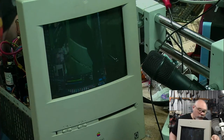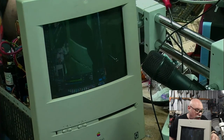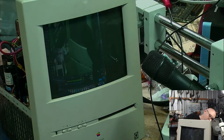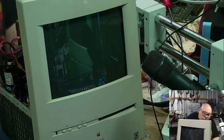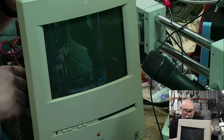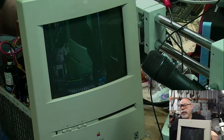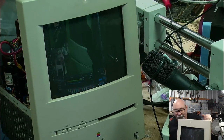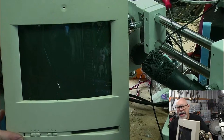All right, so connecting up all these cables again. There's a whole bunch here. There's a degauss cable, a yoke cable, the CRT controller, the microphone, the speaker, and stuff. So let's get this connected. Yeah, that's nice. Always double check that everything is connected, because if you're putting these things back together and, for example, forget to connect up the ground wire, you can break things. Not aimed at anyone specific.